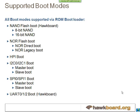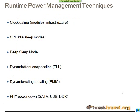For the boot modes we support, on the Hawkboard itself we have a NAND flash boot and a UART boot. The chip itself also supports other boot modes such as NOR, HPI, I2C, and SPI boot modes.